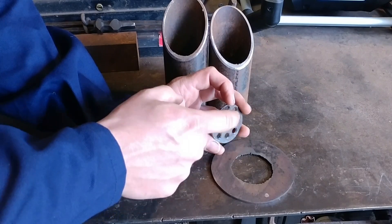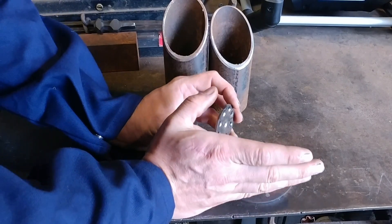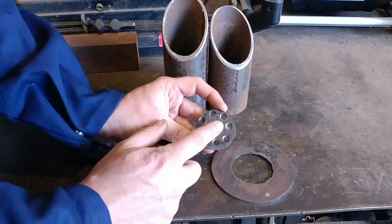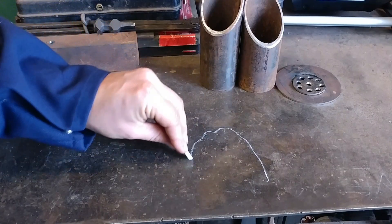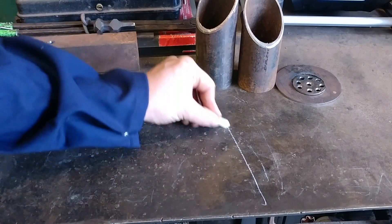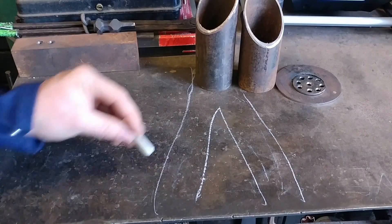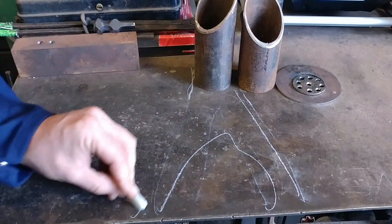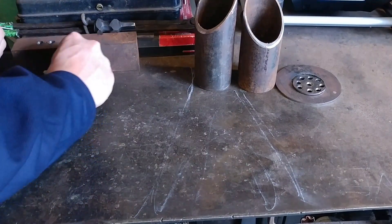The screen mixes the gas and keeps the pilot burning, which allows the center cone to stay hot. The center cone is the hottest portion of your flame versus the outer cone. It's the difference between having a burner with a flame that looks loose versus a burner that has a cone that is tight. A tight cone is a hot flame; a loose cone is a lazy flame. That's why these things are built as they are.